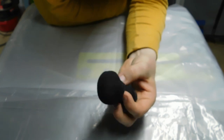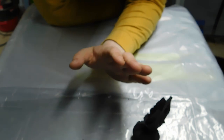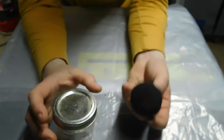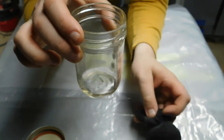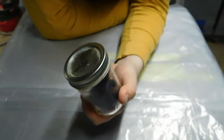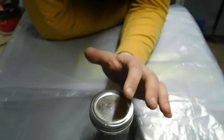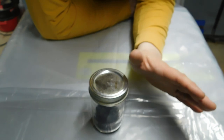One of the really cool things about shellac is that it is soluble in alcohol. That might be bad for bar tops or similar, but it is really good for reusing your applicators. In between uses I take a little bit of alcohol and drop the applicator right into one of these pint-sized mason jars. You can see it's already absorbed that alcohol — there's nothing left in the jar. It's going to distribute relatively evenly through the pad while it sits on the shelf, keeping everything soft.